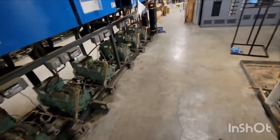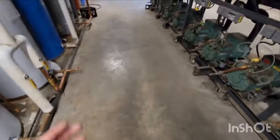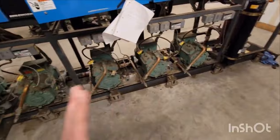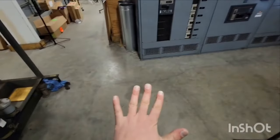If all of that checks out immediately when you get there, and you think, I don't understand, all my compressors have oil, my oil reservoir is fine, and you just look at it and see that everything is failing, more than likely it's low refrigerant and you should check that. Just wanted to give a somewhat clear instruction on that.